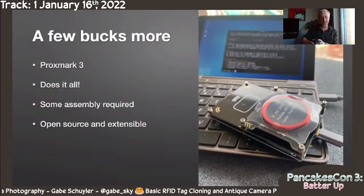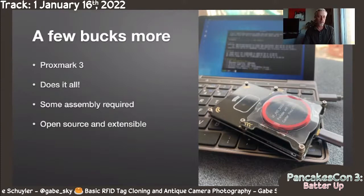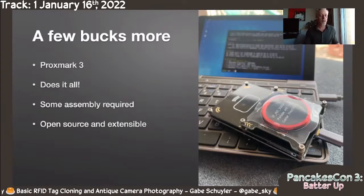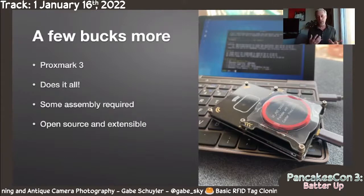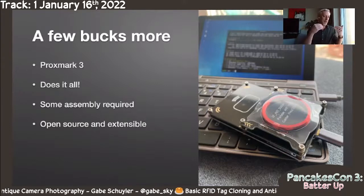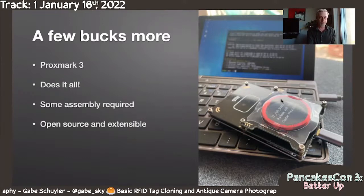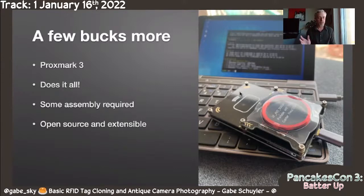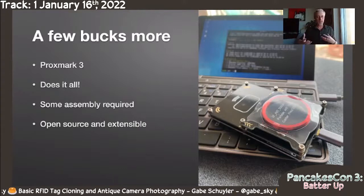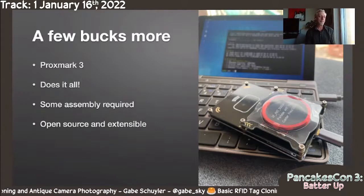The Proxmark 3 is pretty much the only thing I've found that really makes things easy. I'd usually be vendor neutral, but this design is really great. It is open source, so somewhat vendor agnostic — you can get them from a bunch of different places with the firmware already built in or not. Some assembly will be required. You'll connect to it with a USB modem interface. This red coil is an antenna for low frequency, and there's also an antenna for the high frequency. It can read and write pretty much anything. If a card's encrypted you'll have to do more work, but for something like my building lock it's so rudimentary that it just works.